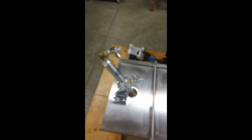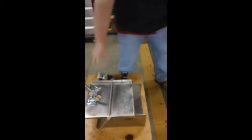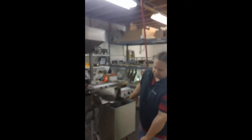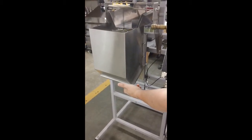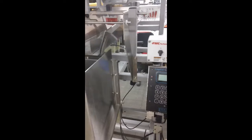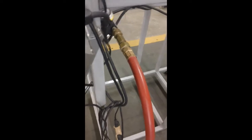Make sure that your air compressor is on before doing this, as I'm going to introduce the air to the nozzle. Before you put your hose on that nozzle, just take one finger and close the hopper door. Don't apply too much pressure, as that is the unit that weighs your product — it's a calibrated device.